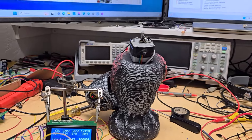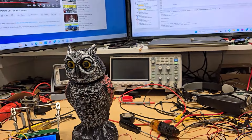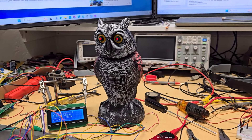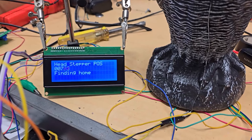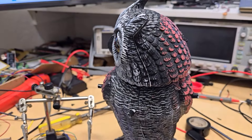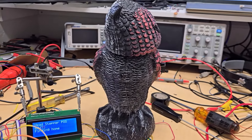Real slow with those beady eyes flashing - so when pigeons walk by over here it'll turn the head there. As I do this I have to keep calibrating how many pulses it is. It looks like it's going to be about a thousand pulses now from left to right, now that I have the extended head movement. Writing to it - looks like it just finished, so it should do its homing thing. There we go - thousand pulses to home.